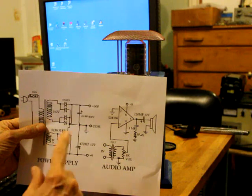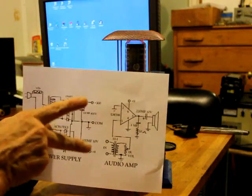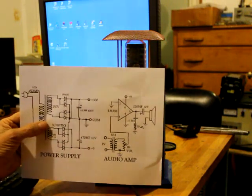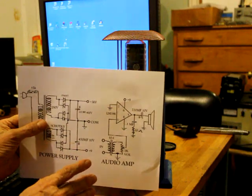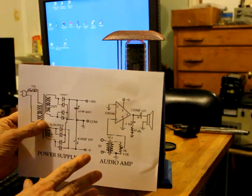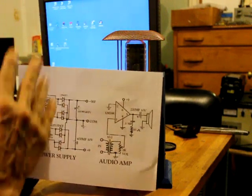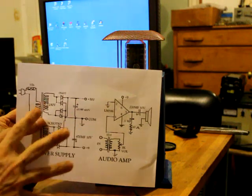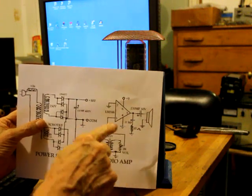There's a little gotcha when using the speech recognizer. The output of the speech recognizer is an H-bridge, so its output sits at about half power supply — about two and a half volts — and it swings plus and minus two and a half volts. You can't stick that directly into the power amplifier. The direct output is very low, probably about 20-30 milliwatts. So you need a little amplifier on it. We use a little transformer to isolate that offset from the output of the speech recognizer, and a little volume control to set the volume.